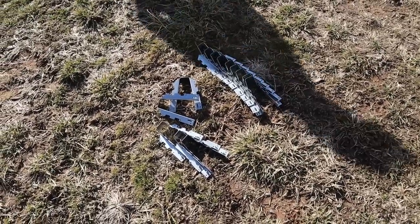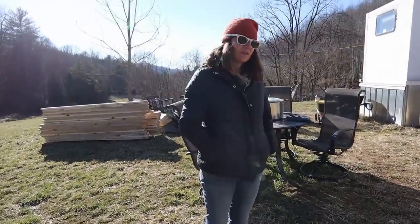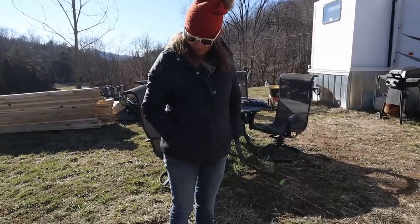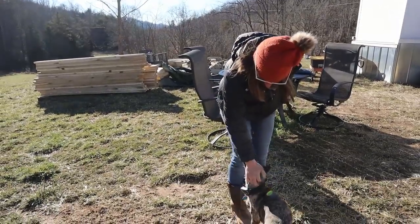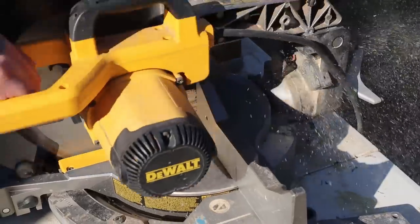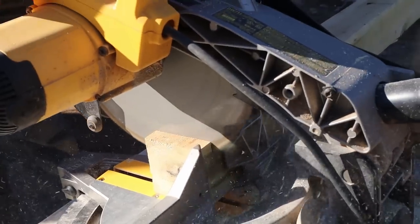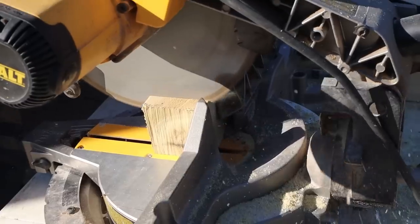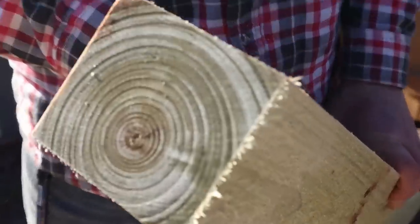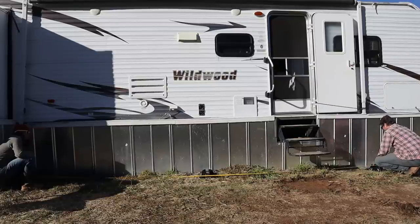We're doing them, the girders, or the joists, I'm sorry, are going to be, what, 24 on center? I think that's what you designed, right? Yeah, and I got an idea of span tables, so we're well within that. We're using poplar instead of pine, so we use the pine span tables for what we're doing. That's 18 feet right there. All right, look at that.